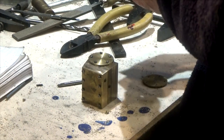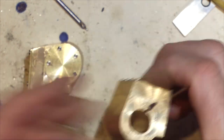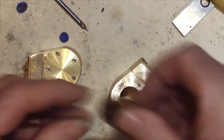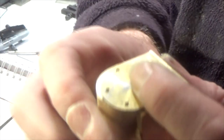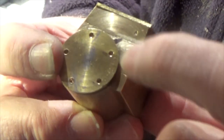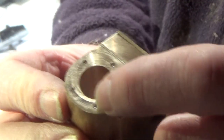I'm just starting to do some work on the cap — the cylinder block cover that's going to go on this end. I've done one already; it's really just a case of turning a simple blank. You can see the holes that have just been spotted through — that fits on there, and you go around with the drill and put the spot marks on. What I'll do next is drill and tap these holes.